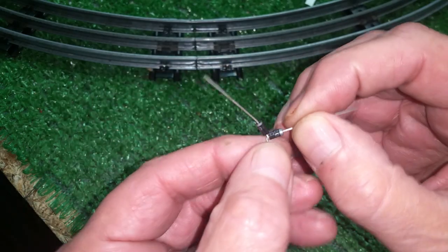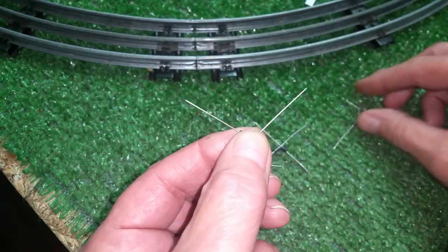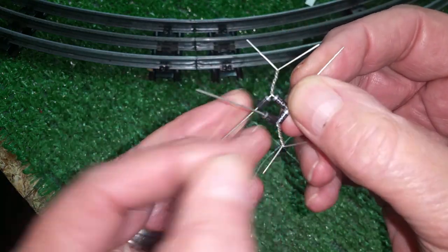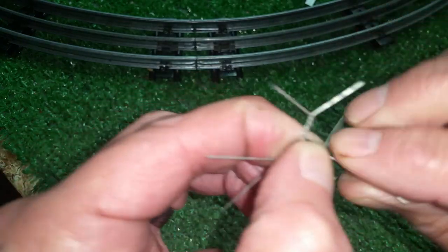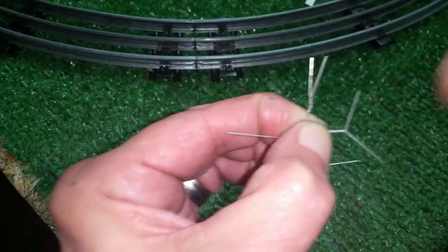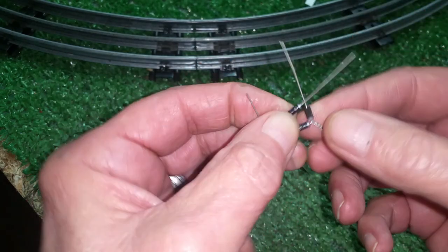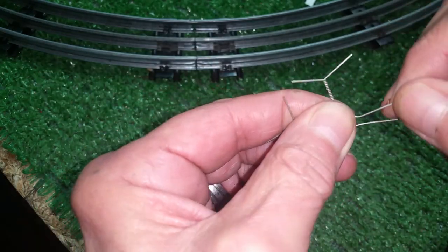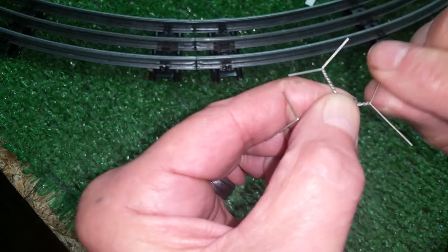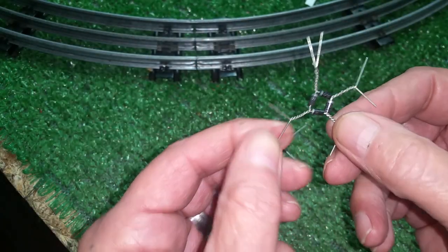These have both of the silver stripes on the top. Now, taking these two diodes, we're going to connect them to those two diodes. We just take these two diodes and twist them together — doing this while looking through the camera, so it's a bit difficult — and then go over and twist this side together. And there you have a full-wave bridge rectifier.